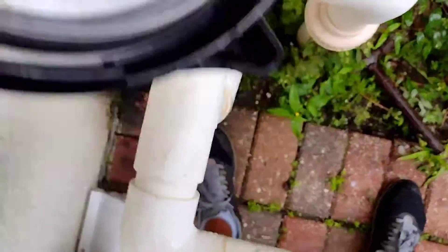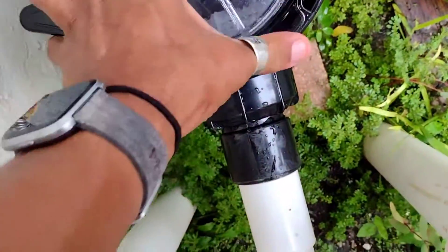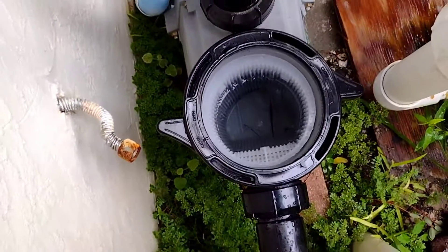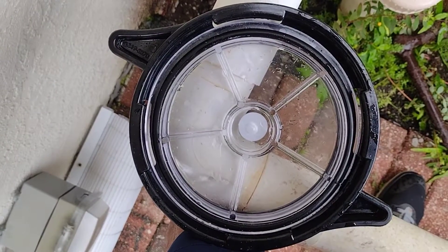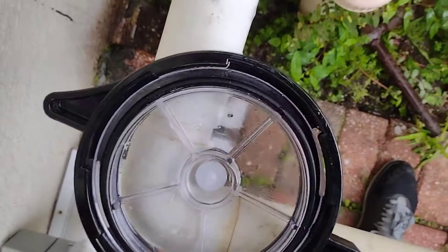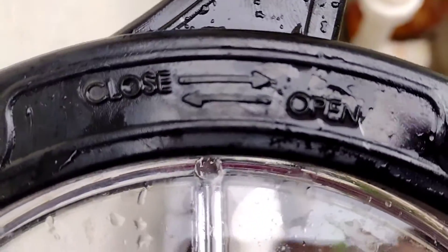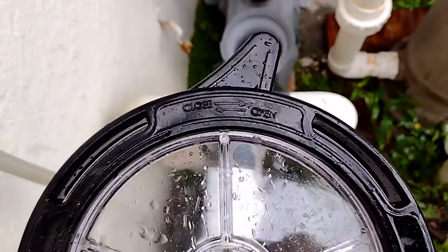If you needed to put silicone on the pump cap, do that and then put it back the way you took it off. I normally keep my American flag logo facing to the front — this is a made-in-America pump, not a Hayward pump. Put it back with two hands and snap it back in. You can also use silicone on it if necessary. On most of these pumps there are instructions showing 'closed' and 'open' directions — look for those and move it the right way when closing.